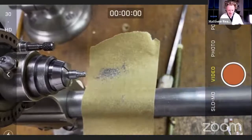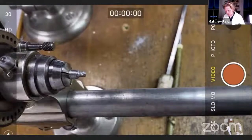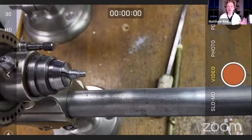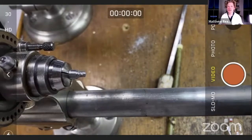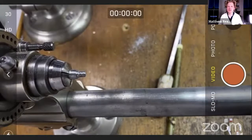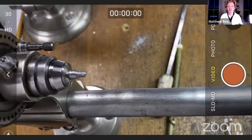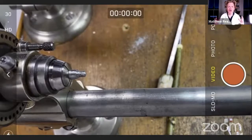And it's kind of tricky because, without going off on yet another tangent, I see people advertising, they say, oh yeah, I do conservation and restoration, and I don't believe it for 1 minute, because of course, as we say on the Facebook group the whole time and everywhere, it's not actually about the doing, it's about the thinking. And I think it's really difficult, and you get compromised. There's nothing wrong in putting a new thread in there at all, I'm not against it. But I would say I've never put a new thread in a historic clock for the past, I don't know, 10, 15 years or something. So matching threads, and you get a lot of faff like this.